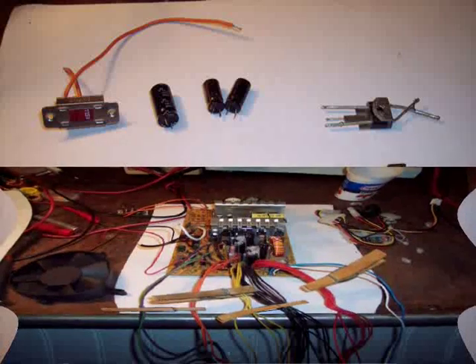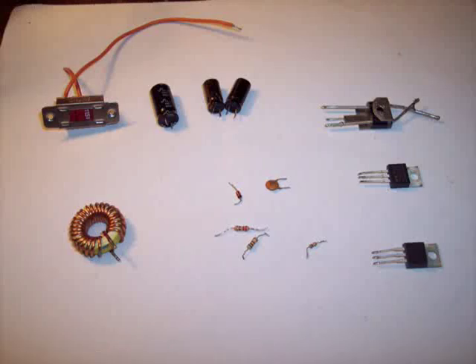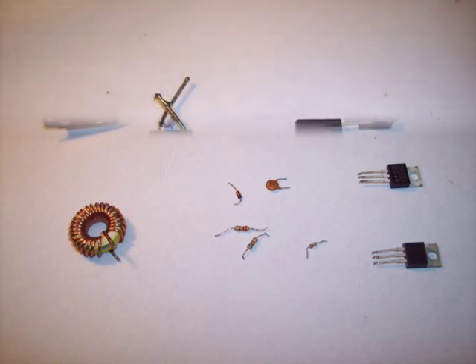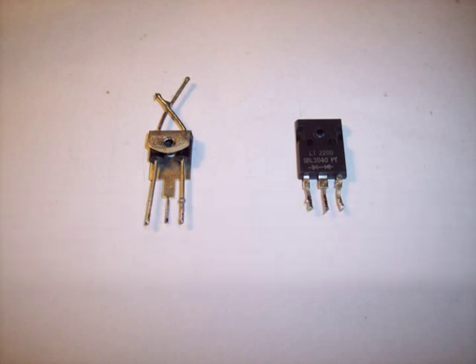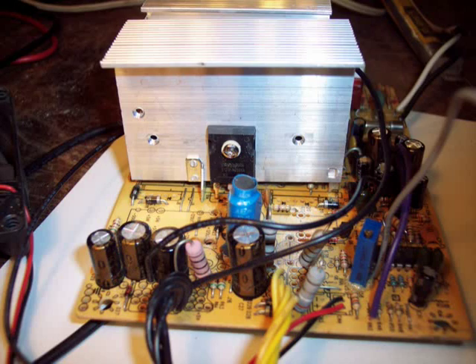Here are some of the parts not needed, and they should be removed to give you more room to work on the circuit board. These are the main rectifiers from the 12 volt supply. On the left is the original one, rated at 10 amperes, and on the right is the 30 ampere unit that I use as a replacement. The 5 volt rectifier was on the left and the 3.3 volt rectifier was on the right — both were removed as they are no longer needed.